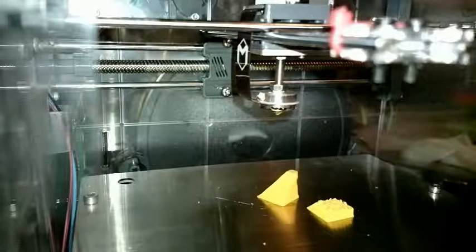So, what's the testing going to be? Well, the first basic settings are 0.2mm layer height, 200 degrees Celsius on the hot end, 60 on the bed, but the bed doesn't seem to matter too much. I'll be using the yellow PLA filament all the time, and we're just attempting to get jobs that finish without jamming.